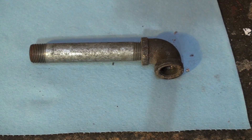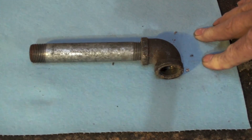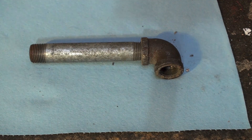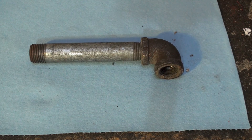Now you can go too far — you can pull a thread right out of them. But the key to this is making it tight using pipe dope. Because the threads themselves are not real smooth, you need something to fill in the little gaps. So use pipe dope.